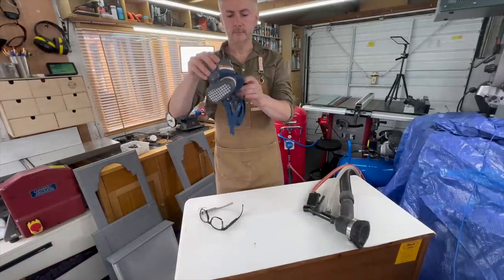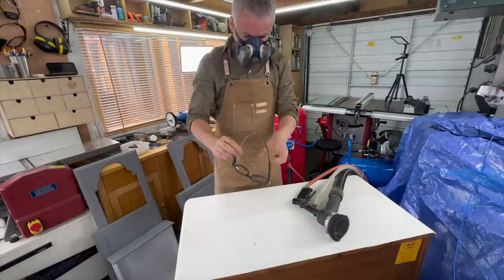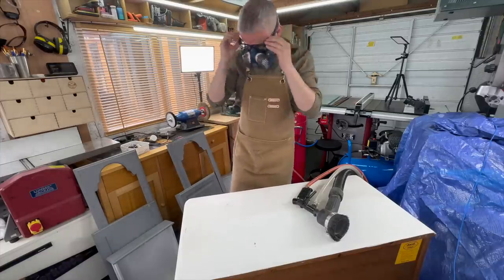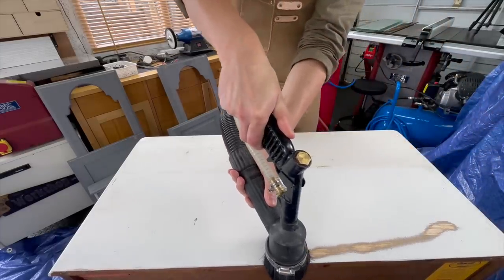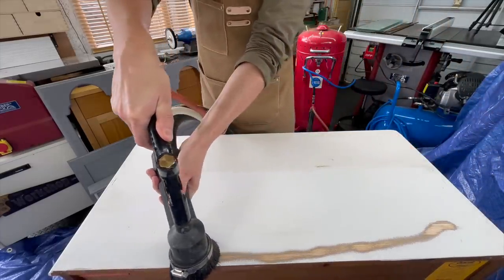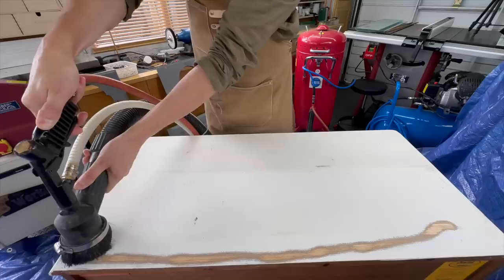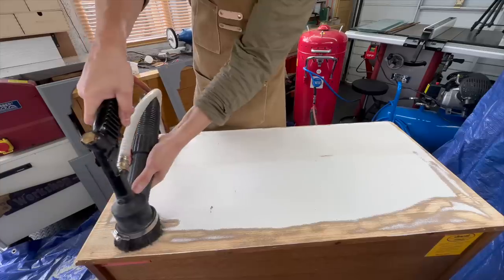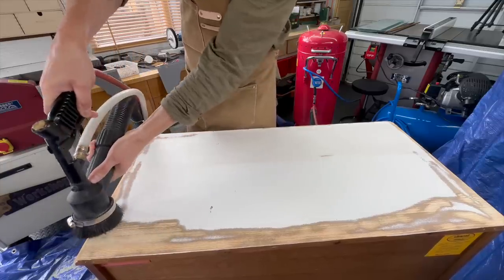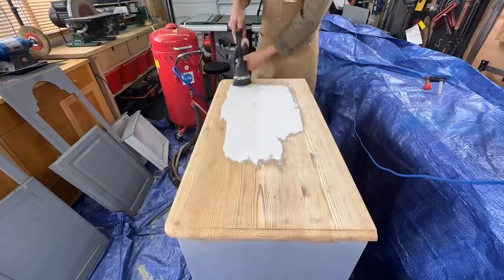When I work with pine, I always try to do something to make it look a bit more interesting, as it's typically made with many different types of boards, with grain going in all sorts of directions and knots, and it just isn't very visually appealing. I wanted to make the grain look 3D, and I've done something similar with a nylon brush before, and in this case I'm actually using a sandblaster that gives me a very similar result.